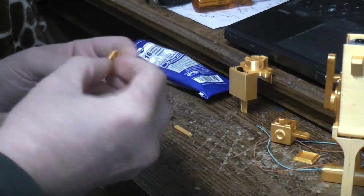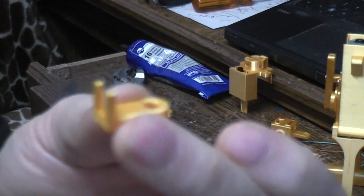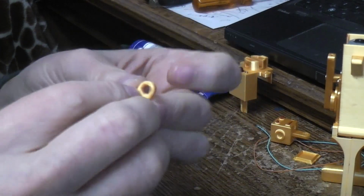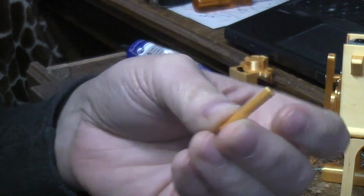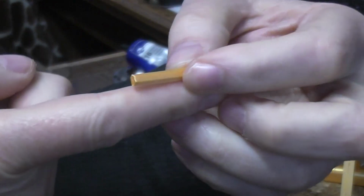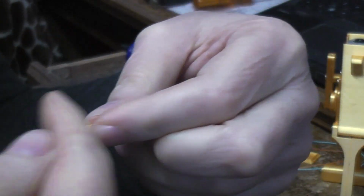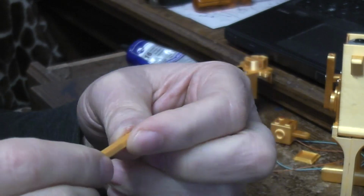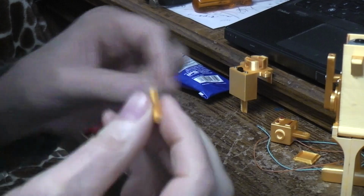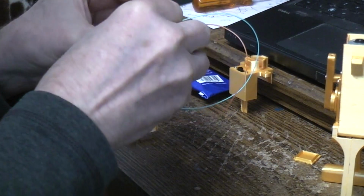What part of the head tipping stuff has to do with this little piece, which prints flat with no supports like this on your printer. It has a hex opening there, and we have a hex shaft which prints flat on your printer this way for strength, because that way your layer lines are running the length and it'll be less likely to snap. Plus, when it fits into the other hex openings, let's see if it has one end that it favors.